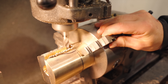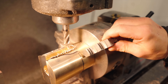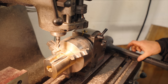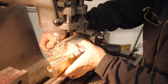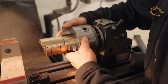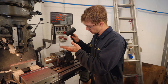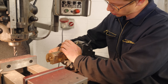Oh crap-a-doodle-roo! No, no, no! I think I just broke my indexing head. Why is that spinning? This is not meant to happen! Apparently this little tiny weenie indexing head is not cut out for the task that we had it working on today. We've been putting far too heavy of a cutting load. I think I found the problem — it's threaded on, so lesson learnt. If you've got a little dividing head like this, it's very possible that it unthreads. So watch your cutting forces.